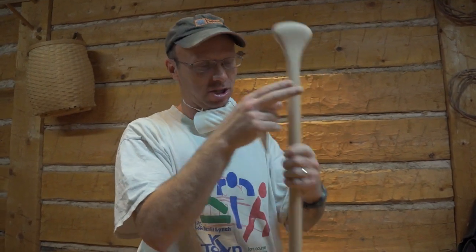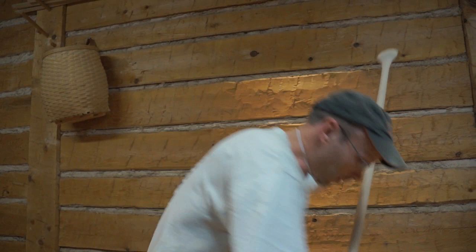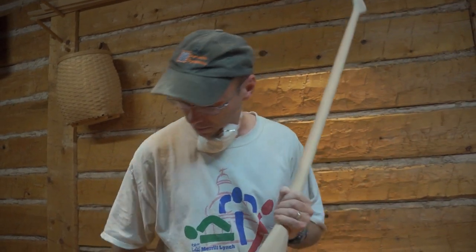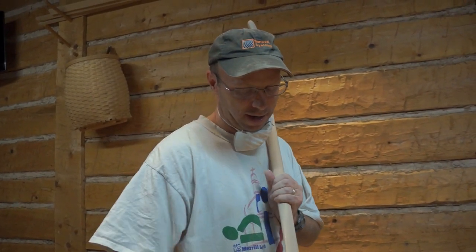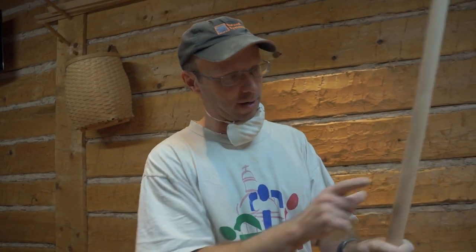Beautiful wood — of course, it's going to get much darker than that. So you started not from just a piece of wood? Well, they cut out the blank for you, so it's already in this shape pretty much. But we have to do quite a bit of planing down with the spokeshave. That's basically what we've been doing — the whole day yesterday using this, called a spokeshave, to get the shape down, to get the thickness of the blade exactly where you want it. It kind of gets a little thicker — you can see there — as it goes up, and then rounding out the shaft and doing the grip so it's nice and rounded and it fits your hand.